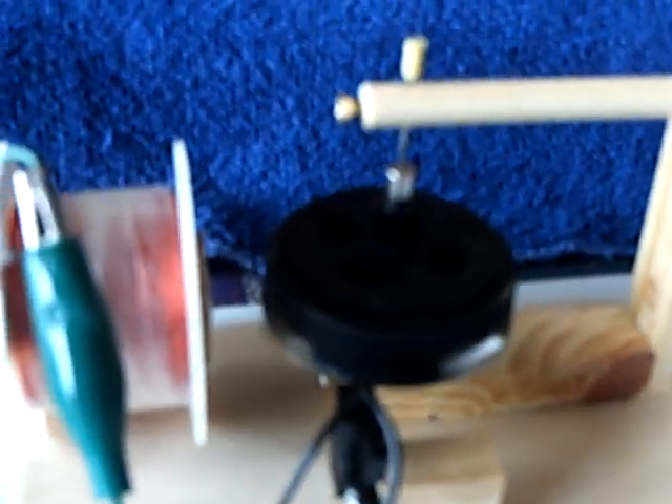I've also been playing with a new rotor design on a Stubblefield-type arrangement. Laser saber wrote me and said to add another pin on the bottom shaft to stabilize it, and I did that today — it really helped. There's a battery in there: magnesium ribbon coiled inside a copper tube with cotton cloth separating the two, then moistened. You can take this little battery out and the rotor will still run. It's just a coil of magnesium ribbon inside the tube with moist cotton between the two.